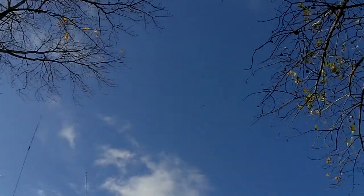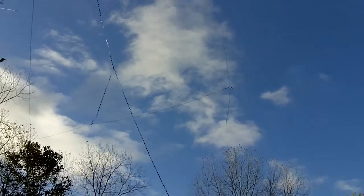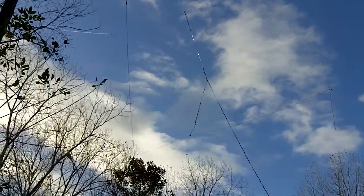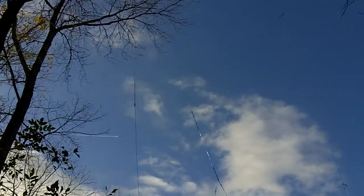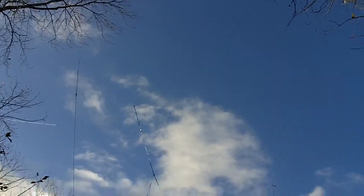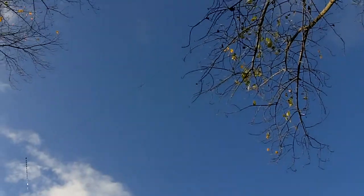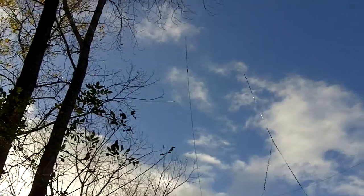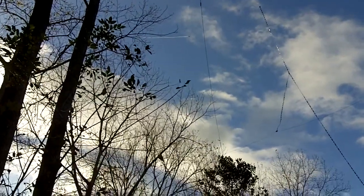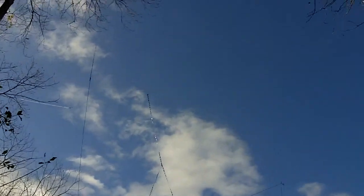The elements are in phase broadside, but as far as straight up and down they're out of phase, so any noise coming down from the sky directly above gets canceled out. It's a very quiet antenna and boy does it hear — it's got great receive. Generally if there's any skip at all this thing will hear it, and if nothing is heard there is no skip. It's amazing how well these things hear.